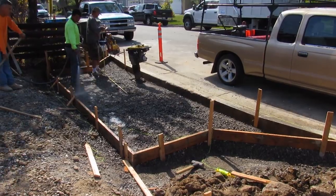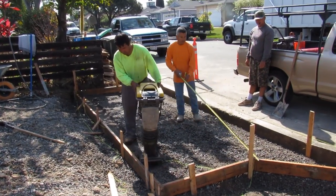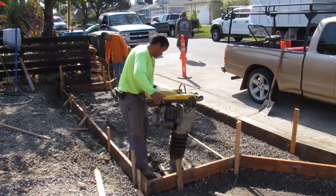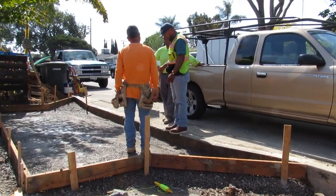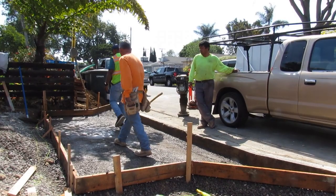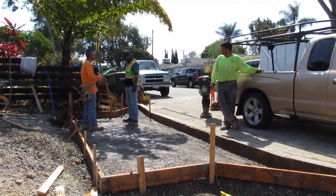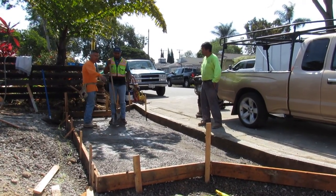I had Charlie Case bringing the concrete on hold. Here we are whacking it down — you've got to get 95% compaction. This is all same-day demo and setup. Here's Jose the next day; he's checking the site. That's considered a sidewalk right behind Javier. They wanted 2% slope there, and then they want the approach at 10%. You've got to have a smart level to get the percentage — it cuts the math out of the equation, makes it super simple.